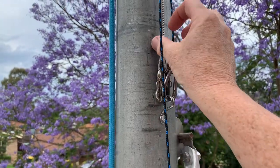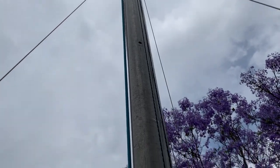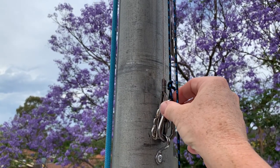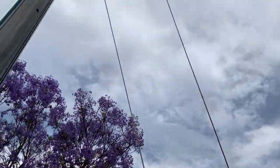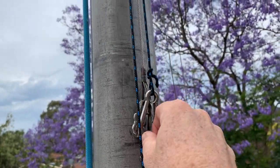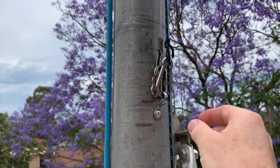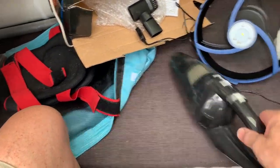Job seven: this is my main halyard and this is my topping lift. The topping lift needs to go behind the shrouds, and these two need to go in front. It's always been a problem since I've had the boat — the main halyard and topping lift get tangled, either at the top so I can't fully pull the main up, or they get wrapped around the shrouds and sometimes even the forestay. I've put this pad eye on and distributed it so what needs to go behind the shrouds is there, and what needs to go in front is there. I'm hoping that will solve a lot of my tangling issues.